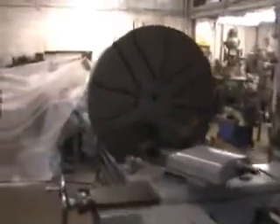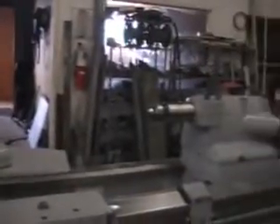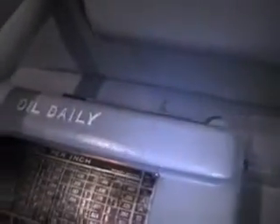This machine has 31 inches swing over bed, 46 inches swing over the removable gap, 19 inches over the cross slide with 108 inches between centers. The spindle taper on this machine is an L3 with the spindle bore diameter of 2 and 3/8 inch. It has 16 spindle speeds from 6.5 to 400 RPM. It has 56 threads from 23/32 to 46 TPI.